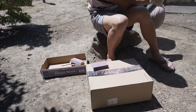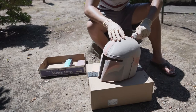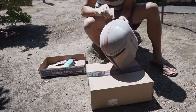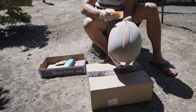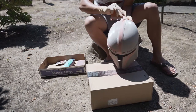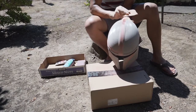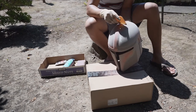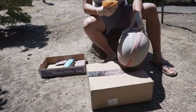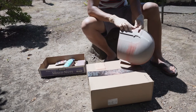I used the canned air to spray off some of the dust because it's kind of toxic — you don't want to be breathing that stuff in. Be sure to do this outdoors or in a very well ventilated area. I was wearing a mask the whole time but I could still smell the Bondo, that's how bad that stuff is. As you can see, I'm reapplying some more Bondo to certain areas after sanding down to the 3D print.